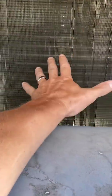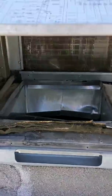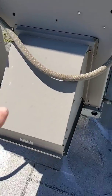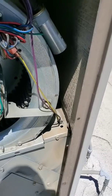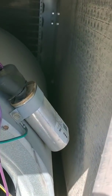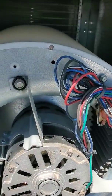You want to make sure this part is very clean. If there's a filter, change it. On this one here, the coil is actually exposed - this one goes into your suite. They probably have a 20x20 or two 20x20 filters for this unit, probably up in the ceiling. So like I said, this is your return air and that's your supply air. This is your indoor blower - this is what actually blows the air into the building. I would check that run cap there - whatever microfarad it is, whether it's a 5, 10, 15, or 20 - just check it and see how close it is. If it's low, request to change it out, because sooner or later it's going to overheat and not work.